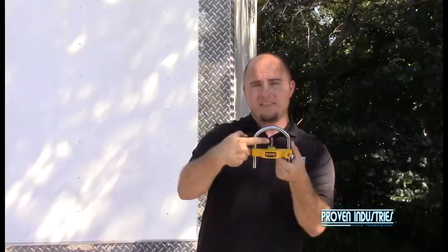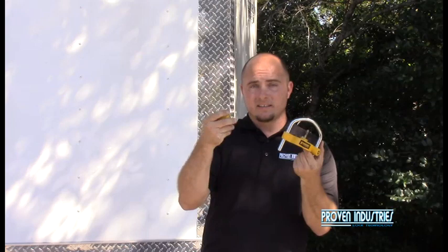As you can see, this one's made of a cast aluminum. And when I put a pry bar, as I demonstrated earlier, right over here and produced a little bit of leverage on it, it made the ball pop off like so. And that's because it's made of cast aluminum. As you can see right here, you can see the threads from the ball still on the bolt. And that's because it is cast aluminum, which is a cheap material. A lot of manufacturers like to use it because it keeps production costs low. So unfortunately, that is why this one failed on us today.